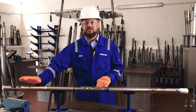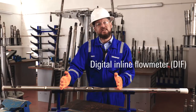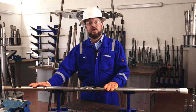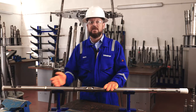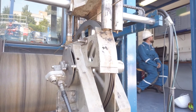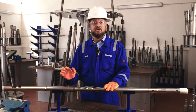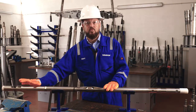We've got three tools here. We've got the DPG which is a pressure and temperature gauge. The DPG means that whenever we do any run on digital slick line in the well we can actually make that an intelligent run. Rather than just running a standard dummy drift run or a tag run, with this we can already be collecting pressure data for the likes of a gradient survey. With the temperature measurement, potentially if we had a leak in the tubing, we'd be able to pick that up with this tool.